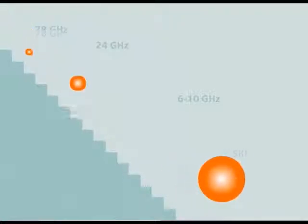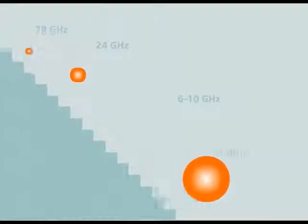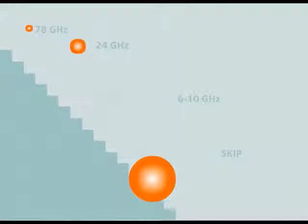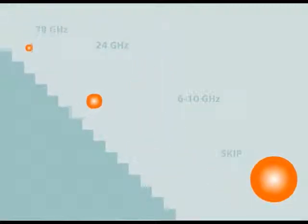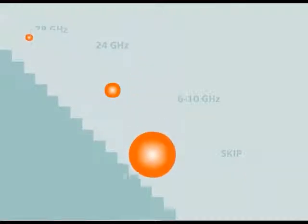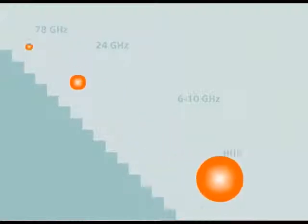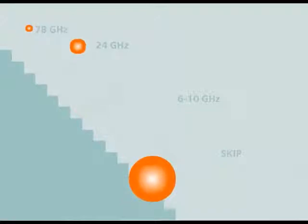Practically all solids have an angle of repose, which causes the transmit signal to split into two returning paths — one direct and one indirect — leading to complicated signals and measurement drift. Picture dropping a beach ball at 10 GHz on a set of stairs, and how it will reflect away at an angle. However, a ping-pong ball will bounce straight back most of the time. The LR-560 at 78 GHz minimizes skip and behaves more like a ping-pong ball, resulting in excellent reflection properties even on highly sloped surfaces.